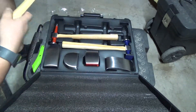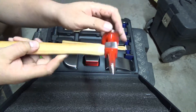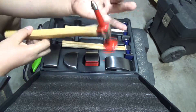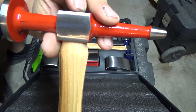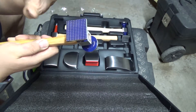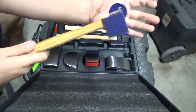Overall it feels good — it has a hickory wood handle, at least that's what it says on it. Here's one of my favorites: you can see the rounded edges which I really like, makes my job easier. The pick right here is not too sharp — I think it's perfect. The next hammer is the shrinking hammer; it's nice and square. I rarely use that one because I feel like it makes more marks than it pulls out dents. This one's nice and flat with rounded edges, which is great especially when you're trying to flatten out panels.